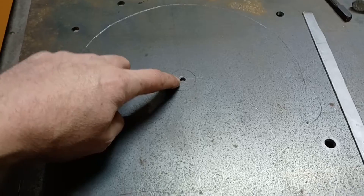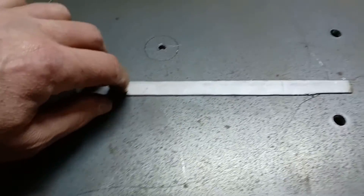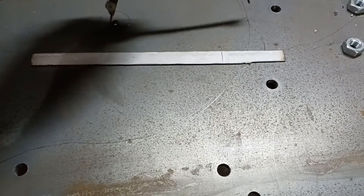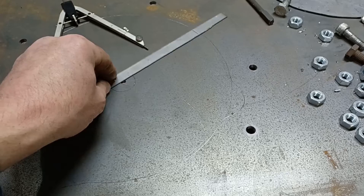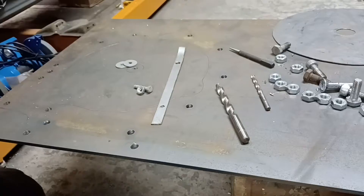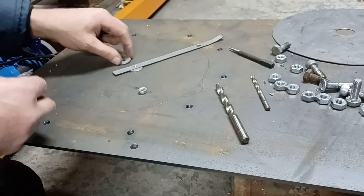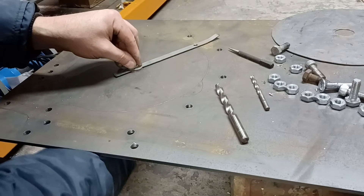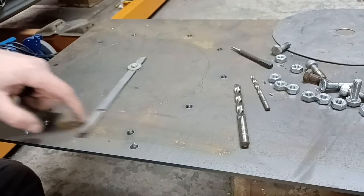From the center I've drilled a six mil hole. All we need to make a simple jig is something with a straight line. I've nipped the center punch in there and used dividers to work out where we need to go - a circle diameter. I drill an eight mil hole in this side because the end of my plasma torch is eight mil, and that slots into there, bolt that onto there, and hey presto we have a divider for the plasma cutter. A couple of penny washers act like a bearing and give a little bit of a gap - not too tight, just not flopping about - and there we have a guide for the plasma cutter.